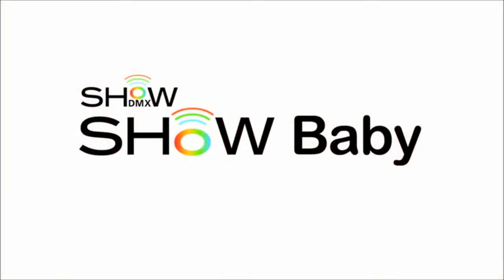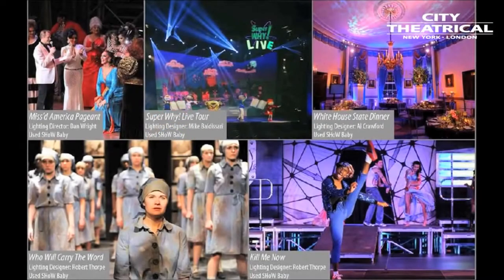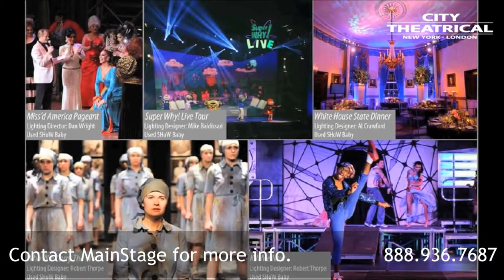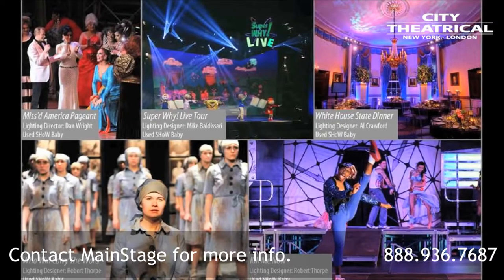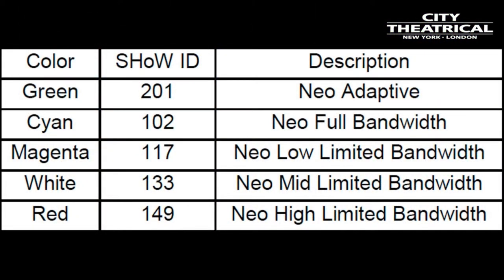Some of you are owners of the original Show Baby, and some of you may have Show Baby 5. So what's the difference between them? All the original Show Babies are locked on one broadcast show ID — they can't be scaled up into larger, multi-universe systems. That's usually not a problem on smaller shows, but since wireless DMX easily passes through walls, if you have two adjoining stages, Show Baby systems could interfere with each other. To solve this, in Show Baby 5 we added the ability to select any one of five different show IDs, allowing your broadcast to happen in a different area of the spectrum, or for you to scale up to multi-universe shows by adding additional transmitters.